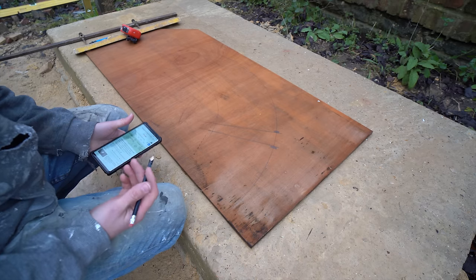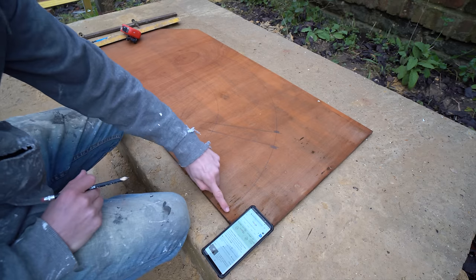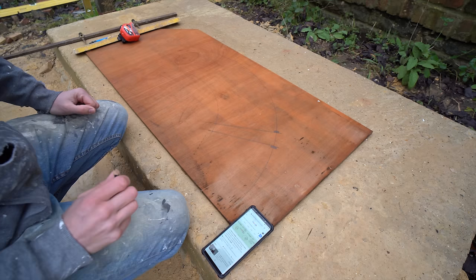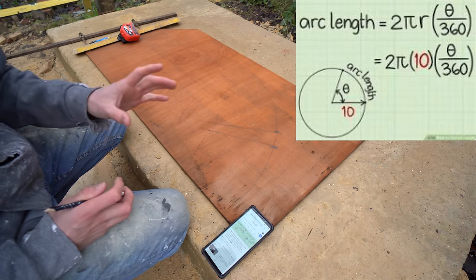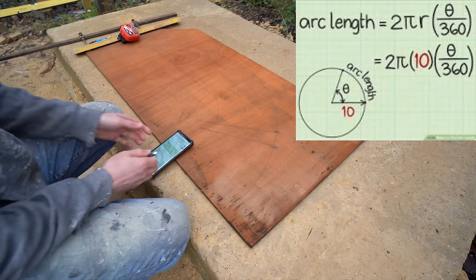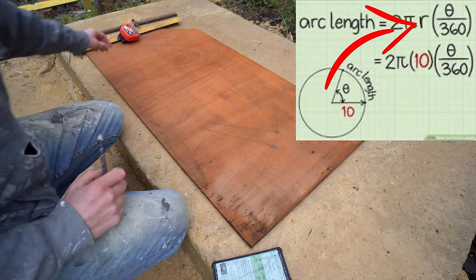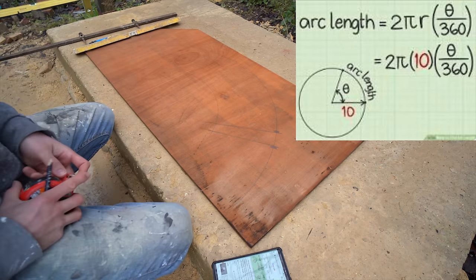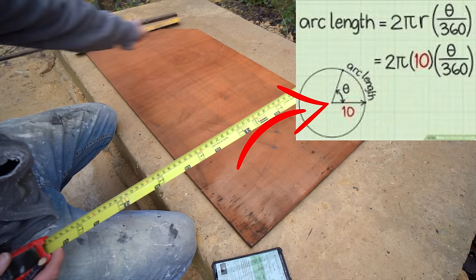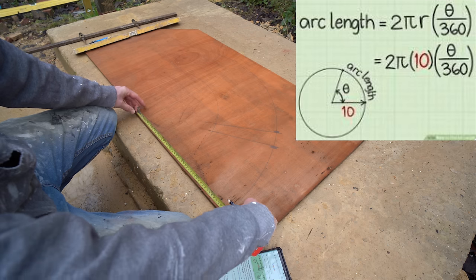Okay guys, this is one of those scenes that I said had to be re-shot, so excuse the fact that everything got wet. From this part, what we need to do is find out the length of the extrados. I'm going to show you an equation for how to work this out — it'll be on screen as I explain it. There are two things I just want to explain. The R in that equation means radius. The radius is essentially half of the diameter of the circle — from the point where we used to mark the arch to the outside of the extrados, which is 515 millimetres.